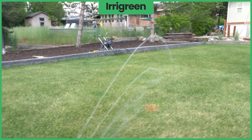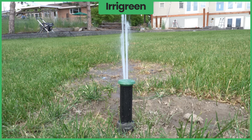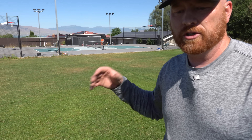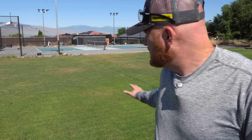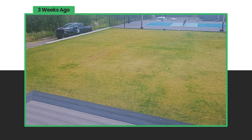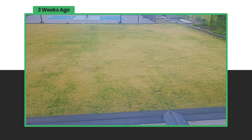The reason why we have such a straight-line box here is because of our irrigation system. We chose to install an irrigation system called Irrigreen — they did not pay us to put that in, and it's been working fantastic. With our Irrigreen system, we can choose how many inches of water per week that we want to put down. We had a broken sprinkler head in this area, and we were having some severe slope issues where all the water was pooling up and causing a massive problem — we had too much water and a little bit of fungal response. That area is getting about two to three times the water as this entire section.